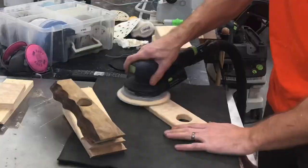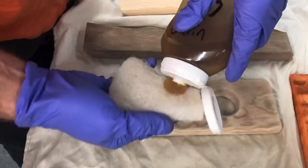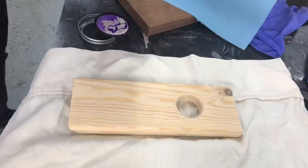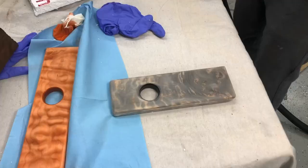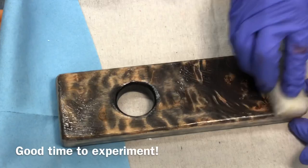As with any of these projects, you can make them as nice or as basic as you want. I sanded them up to 220 grit. Osmo is one of my go-to finishes — you can use really any finish you want. I'll show you how to go a little bit more basic if you want just like a Home Depot finish. The Osmo is a nice wipe on, looks really natural, wears really well, won't show fingerprints or anything like that. This one I did was just Home Depot white wood, regular scrap 1x4 — I dyed it purple and I think it looks pretty ugly, but you can do something different if you got some kids that want to make something for mom and she loves purple. I used just basic shellac. Or you can go a black dye that I had sanded back, then added the Osmo.